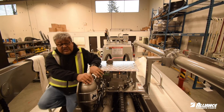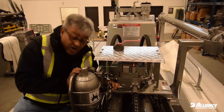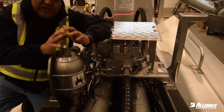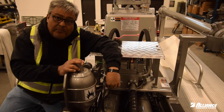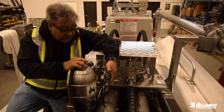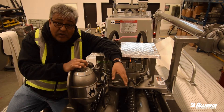Within this newer model of pumps, you are going to have in the volume control system and your manifold for the accumulator another valve. This valve will be tied down in this direction. If you open and close it and you lose power and you are in an emergency procedure, you will be able to adjust more or less the volume of the pump, though you won't have the fine tuning you have with the other one. If you are not in an emergency procedure, please keep the tie down — put the plastic ties in there — because if this one is halfway, you won't be able to control your volume control the normal or regular way.